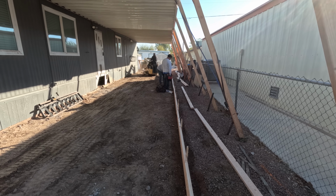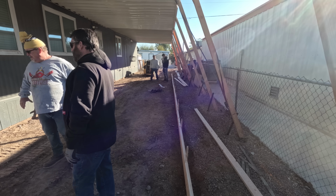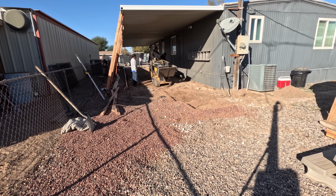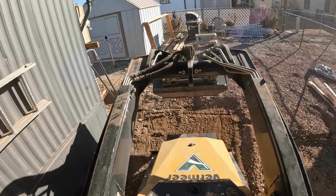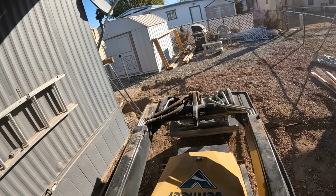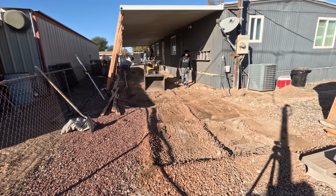It came in handy here because we're stacking 2x4 to get that raised stem wall. So we had a lot of nails. I think we used about 350 lineal feet of 2x4 to form this out the way I wanted to do it. I could have used a 2x8 on the back of stem wall, but since I use 2x4s more often, I elected to stack them so I could build up my surplus, which came in handy for this next job because I've got like 600 lineal feet on this driveway. The next video, not part 2, but part 1 of the next series.